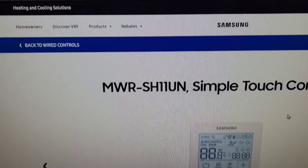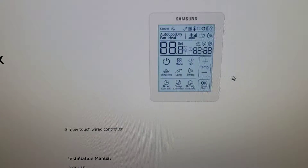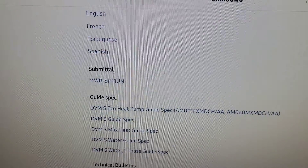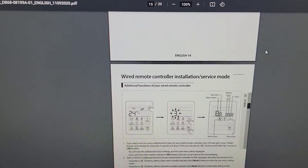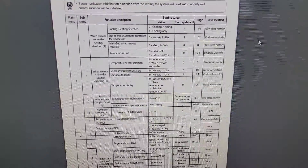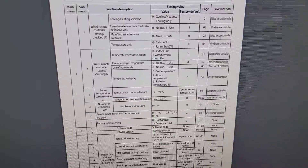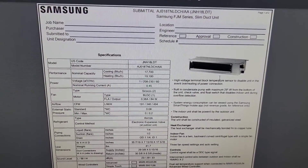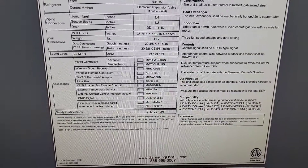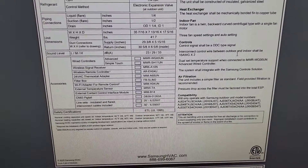This is the simple controller that was installed on that FreeJoint multi-system on the ducted air handler. I found this by going to samsunghvac.com and looking under the technical documents — right here's the installation manual. You've got a submittal for this, but we're going to click on the manual. In the option settings, you can actually set up to use the pump. There are error codes, and then this right here is the option settings. Also here's the submittal for the ducted air handler — that right there was the simple touch controller that is compatible with this equipment. We've got the 16 AWG times two control wire between outdoor and indoor unit, DDC type control.